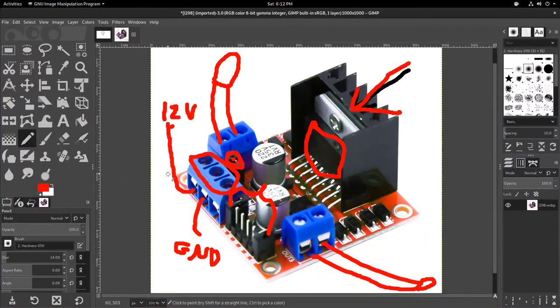You must take a ground pin on the Raspberry Pi and also connect it into the ground terminal on the L298N. Generally you've got the ground wire from the battery going in there, but you also need a jumper wire from ground on the Raspberry Pi. It's critically important that there's a common ground between these — it sometimes sort of works without it due to something called coupling, but it's dangerous and can cause things to overheat. Common ground ensures all logic levels are correct.